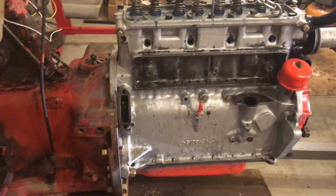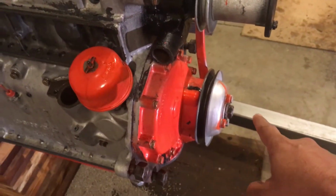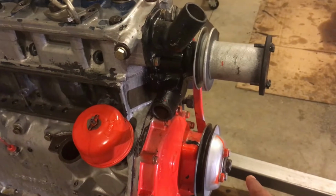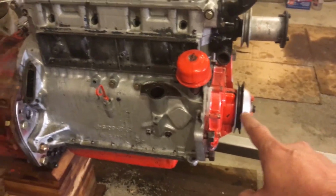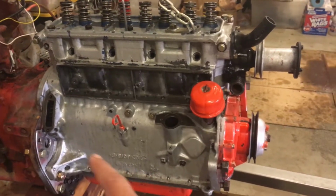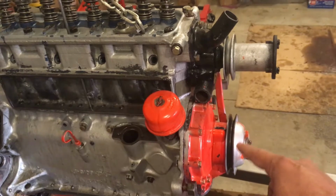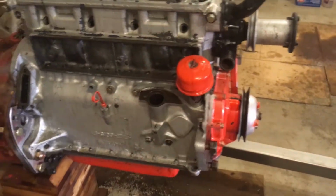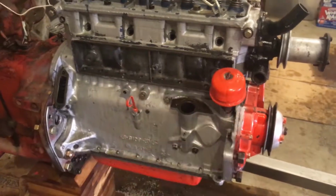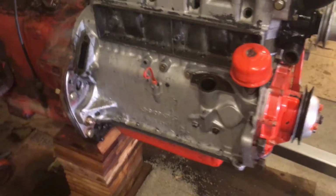However, it's not going to go that easily unless you are lucky. So you need to have a socket wrench ready, and have someone else help, like a second hand. While you are wiggling and pushing towards the engine, try to rotate the engine a little bit, left and right, so it will align with the splines on the shaft, and then it was very easy to push back.